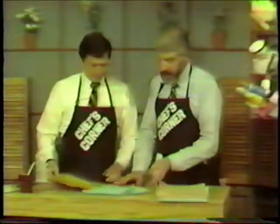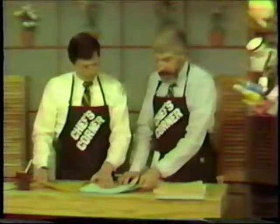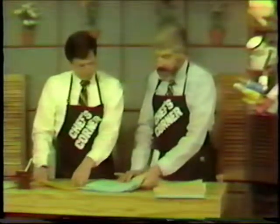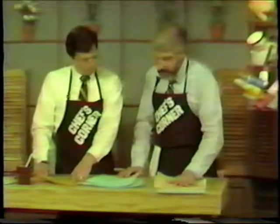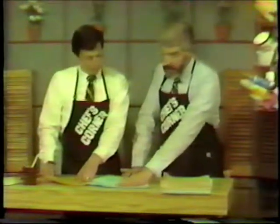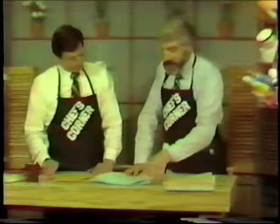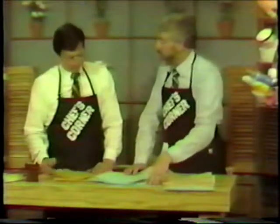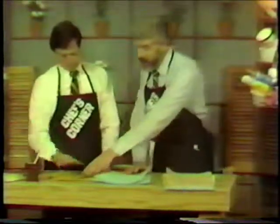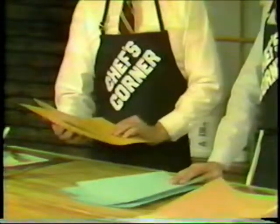Now this one is 2-4000. Okay? 2-4000 means it has a longer run length than the 5000 series, 2-5000. This is now the 500 copy run length. So again, the first two digits indicate where it is on that scale of run length, right. And the last two digits indicate the size and the configuration. I'm with you. And then this is the 2-3000 series. Okay, so this is the 1500 run length.